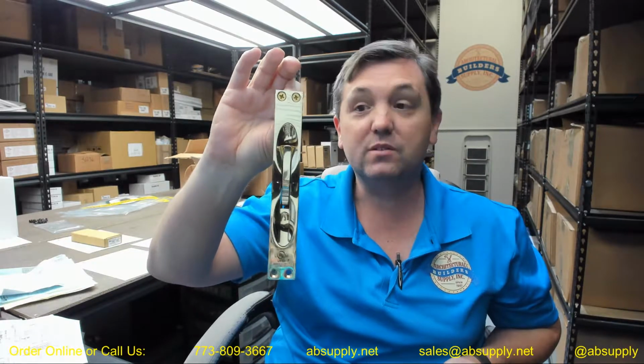So these are fire rated up to 90 minutes and up to pairs of doors, total 8 foot by 10 foot. Now the problem comes in when you're installing a corner style flush bolt on an 8 foot, 9 foot, 10 foot door. You would absolutely need a ladder to get up and manipulate that bolt. About 6 foot would be a good height that most people can reasonably access the flip lever, and you'll see manual lever extension, the 780 bolts, when you get into the taller door heights. You know, to go to a 7 foot, you're probably going to want to consider an 18-inch or a 24-inch top rod, and then accordingly adding on to the top of it as well.